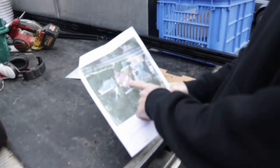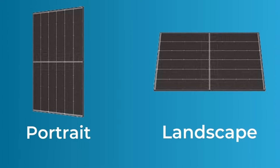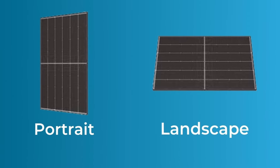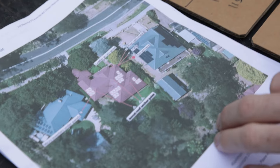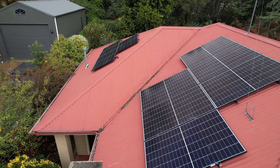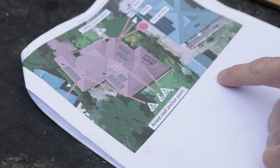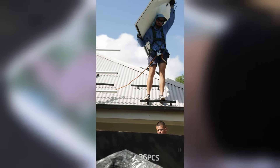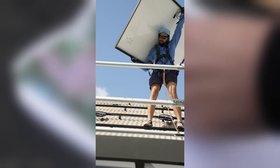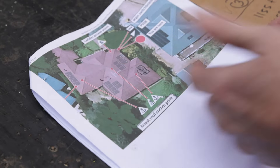So this is our landscape design on the house today. We originally designed all tin jobs in landscape because we know with the screw lines and how the roof is designed, there's a good chance it will fit. The guys have jumped up on the roof and worked out what looks good, what will fit, and what's safe. The roof is actually quite steep and slippery, so we have a second design here — a portrait design. Portrait designs don't always work on a tin roof because of the screw lines, but a portrait design like this one is actually safer for the boys to work on, because when we put our rail down we have places to stand. It also fits in a different kind of way so we can make it a little bit neater on the roof — better experience for the customer and also for the installers on the day.